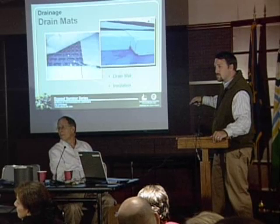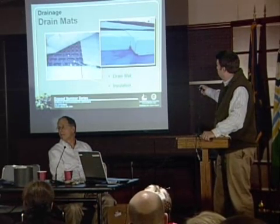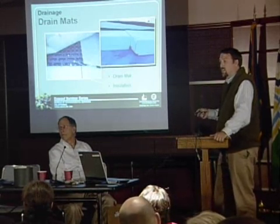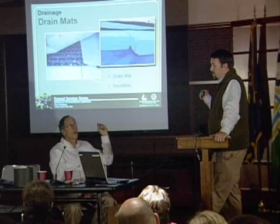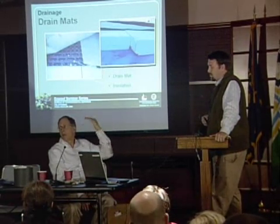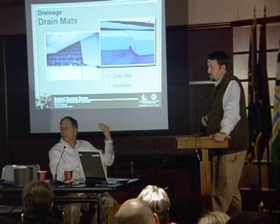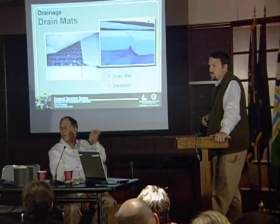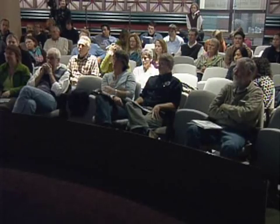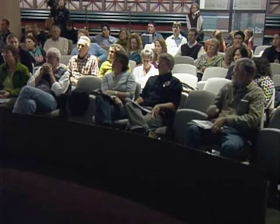Is that additional insulation in addition to the insulation that's required for a dwelling, or is that part of the insulation needed for the dwelling? This is required by the city code. If we were just re-roofing this building, they said we needed our R19. So even if we didn't do retrofitting on the inside, you're putting it on the outside. It was designed that way.